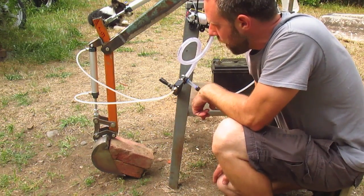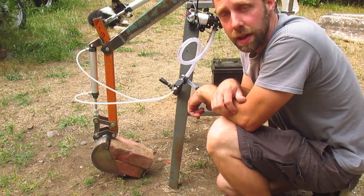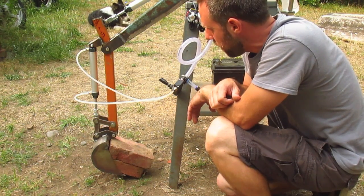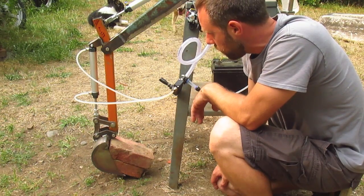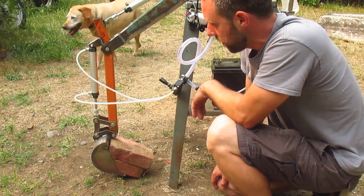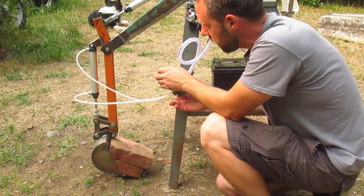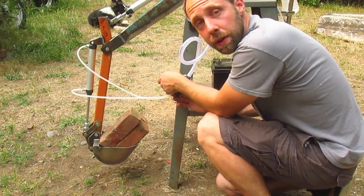To show you the power of it — the cylinder is metric but just slightly under one inch bore, and we've got about 100 PSI on the pump. I've got three house bricks — not the ones with holes in the center — I'll weigh them later, but they're extended about three inches past the bucket. We'll roll the bucket back — that's pretty good power there.